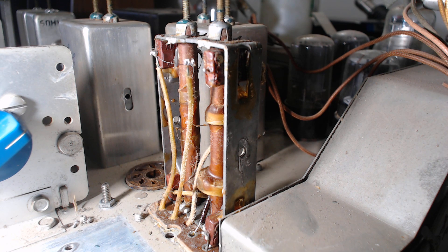I wanted to point this out because I've been looking at other videos and I know those people haven't recapped the entire radio. They get it working, do a video, and then you buy one like I did and realize the FM doesn't work or parts of the AM don't work. You start finding bad capacitors. If you ask in groups, people say they didn't have any problem with the IF can capacitors — but that person never opened them up, because they never mentioned how hard it is to get the lid off.